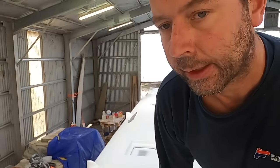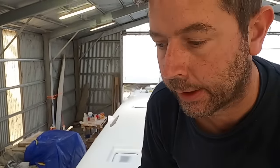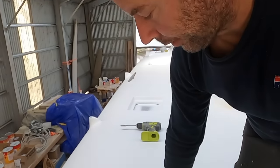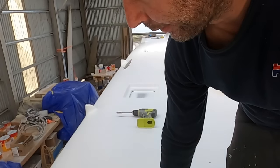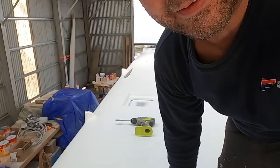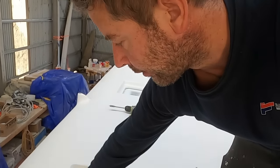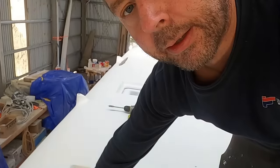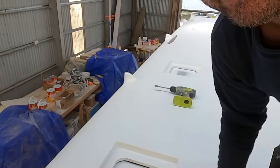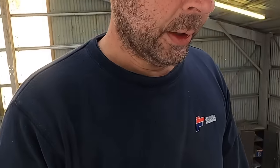That should take care of the water unless I have some really weird trim and list for a long time, which I find unlikely. The height of the ceiling flange on the hatch is high enough to allow pooling water from the inside not to build up over the hatch seal. So I'm going to try to drill a hole through this combing here — I hope you can see that — and another hole through the side of the boat without making too much damage on the inside.